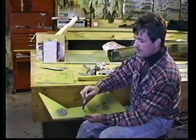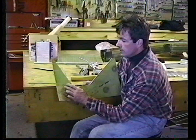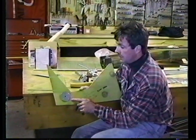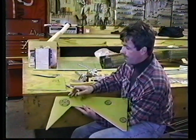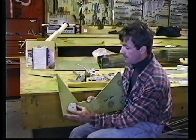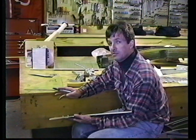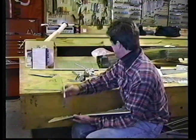Normally, they would come with the gloss surfaces on the interior. The NG8 load distribution washer, you will sand the backside of, and bond in place. This comes pre-drilled, the holes are in the correct place. There is a quarter inch hole on the backside that you'll back drill later. So you'll sand the phenolic area, you'll sand the backside of the aluminum, and immediately apply straight epoxy. Put the appropriate screws in place. They're an AN509-10R, do you remember James? 10R12? I don't know. But I don't think there's any others in the kit.